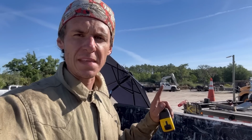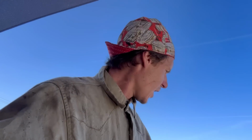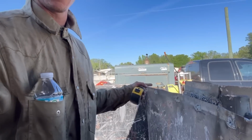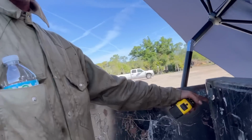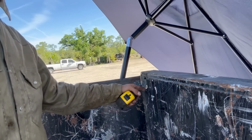So they're over there putting the excavator back together. I was gonna go ahead and cut that piece out, but it occurred to me that this can is probably pretty bent up. So what I'm gonna do is wait until we push it back into place, pull my measurement from right here, so that way I can make sure everything aligns correctly and I don't have some big gap to weld at each end or at one end or however I align it. So what I'm gonna do instead is I'm just gonna come in here, straighten this up real quick, get my welding leads ready, and get ready to put this thing back together as soon as these guys push it.